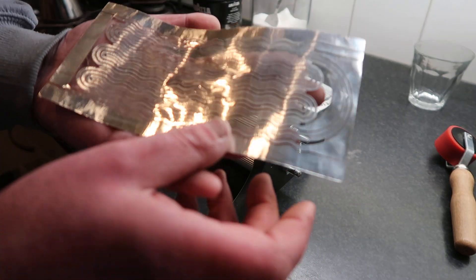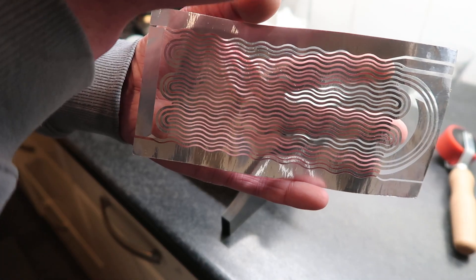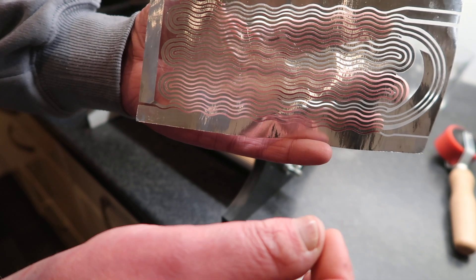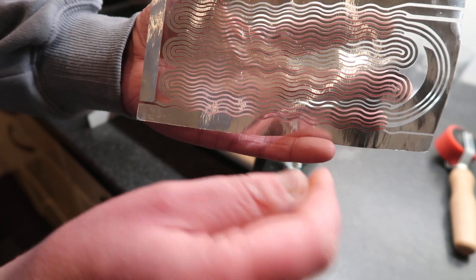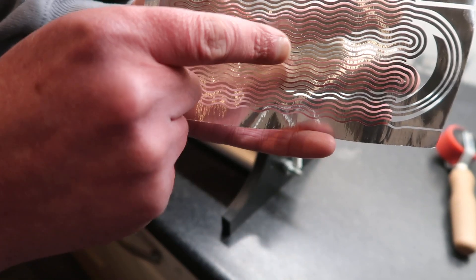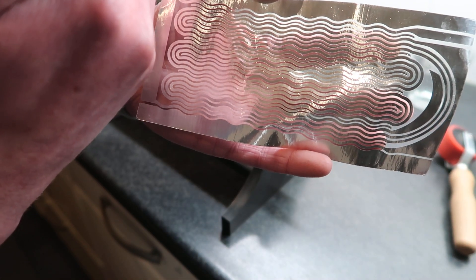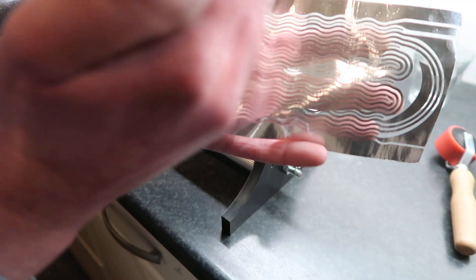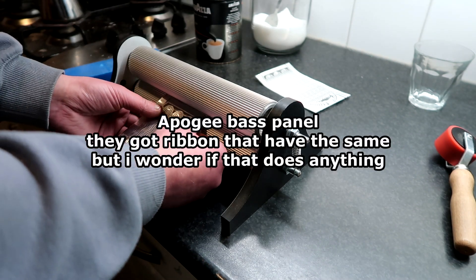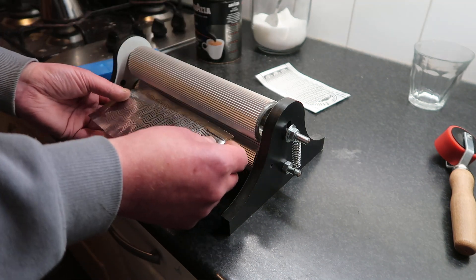If you have this wrinkly design — which is hard to film — so you got a wrinkly design: Apogee is corrugated in this way, and if you had normal traces then some of the corrugation ends up exactly on the mylar and it does not hold corrugation. When you do the wavy design like I did right now, it makes sure that there is some aluminium at those spots. Now I forgot that I corrugate like this — it might matter a little bit, but not the way it does in an Apogee ribbon, at least if you would corrugate it like this instead of this.